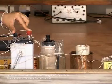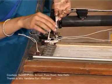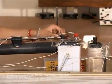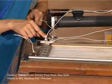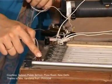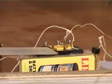This cell that you can see in the circuit is the main driver cell E. One end of it is connected to the first terminal of the potentiometer. The second terminal of the driver cell is connected to the rheostat, which is further connected to a one-way key. This key will be connected to the last end of the potentiometer. We also have a two-way key which is used to connect either cell E1 or cell E2 in the circuit.